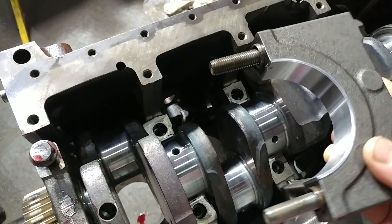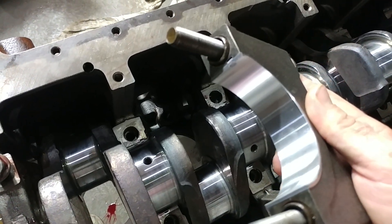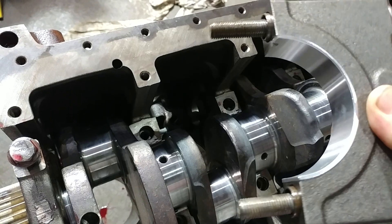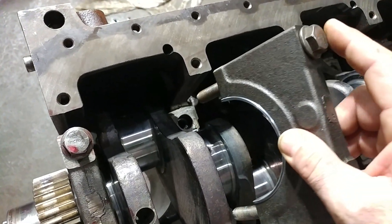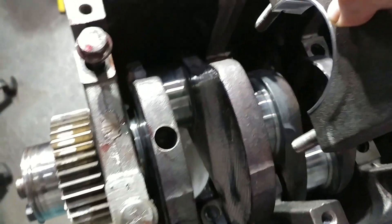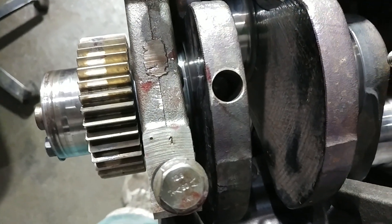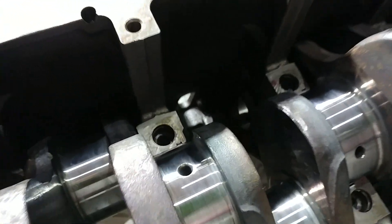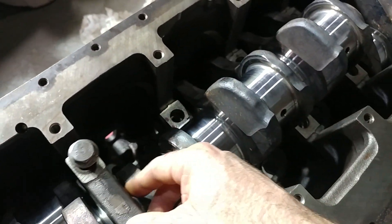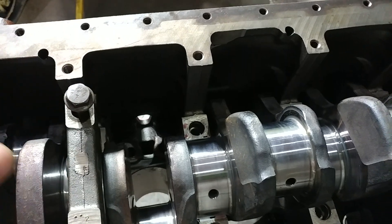There is one thing that I neglected to mention that I should throw in here just in case anybody else is wondering. If you're looking at this, you see how there is a tang on that side — that kind of keyway — then there's a tang on this side. That's how these bearings should go together: tang to tang. And it is very important that you note they come stamped. Before you take this motor apart, if yours happens to not be stamped, you need to make sure that you stamp them. You can see how we've taken a punch and we've put one dot, two dot on this one, and then three dot, four dot, five dot. So we did our own numbering system on it. We didn't have to — it's just a force of habit because some of the other motors haven't had that. But anyway, that's just a little refresher in case you're building one of these.